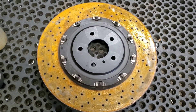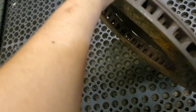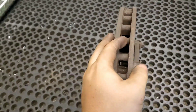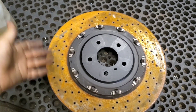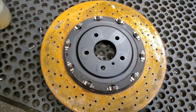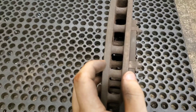The reason a person would want to have their brake rotors turned or machined is because if you brake hard, or your brake rotors overheat, or with a lot of wear, they will get warped. The biggest symptom of that is when you hit your brakes and your wheel starts knocking, or you just feel shaking in your car. Most likely you not only need to replace your brake pads, but you should look into reconditioning or replacing your brake rotors. You can usually machine them at least a few times before they get too thin.